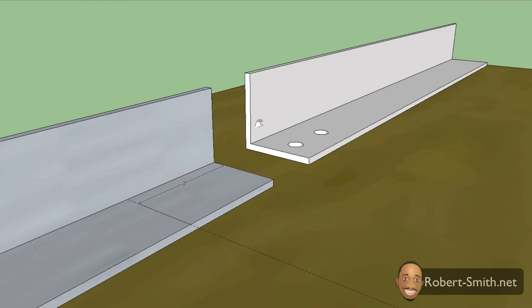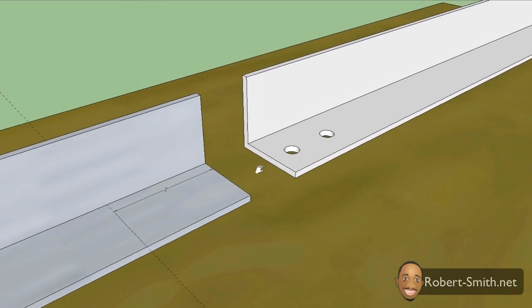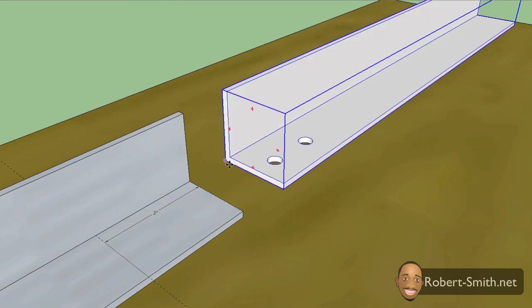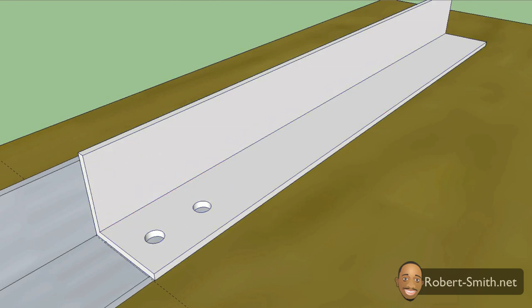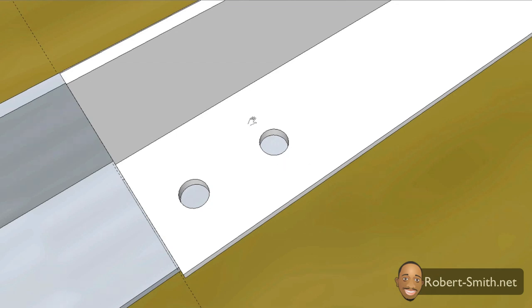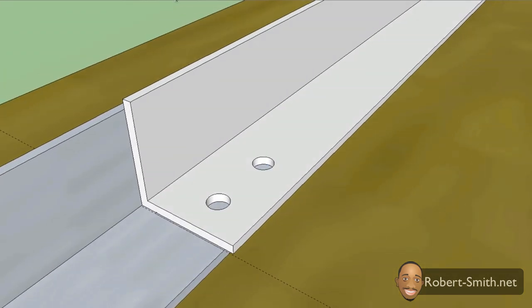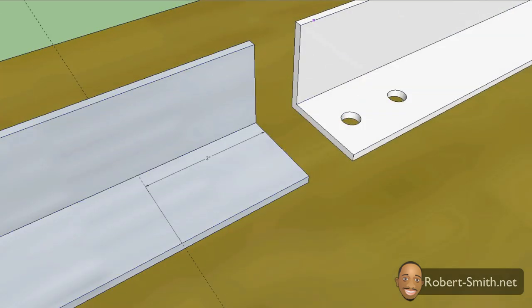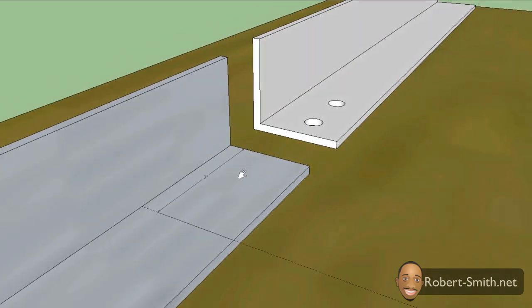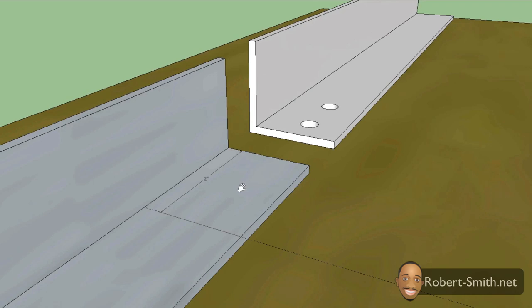Imagine that the piece on the right is the elongated angle piece of aluminum and the piece on the left is the extended angle piece. I marked two blue dots with my permanent marker — imagine those holes are already drilled. I take the top piece, place it back over the extended piece, and since my holes are drilled on the top layer, they expose the layer below. I mark through those holes with a marker, then move the top piece away and drill out those two holes on the extended piece. That's the method I use throughout the video to ensure holes line up evenly.